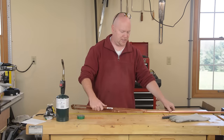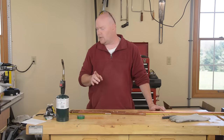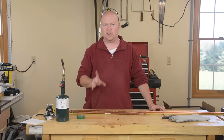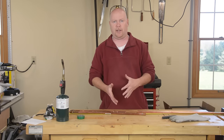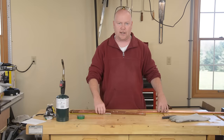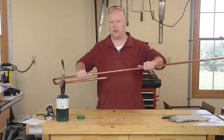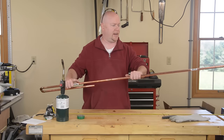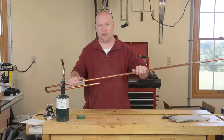The rest of my top long section — I know exactly how long I want that to be: 147.4 centimeters. In theory I could cut this and solder it in, but that assumes I know to the millimeter how far in this thing is going to go when I solder it and that it's not going to expand or contract. So I'm going to do it in the other order — I'm going to solder this in here first and then cut it to length.